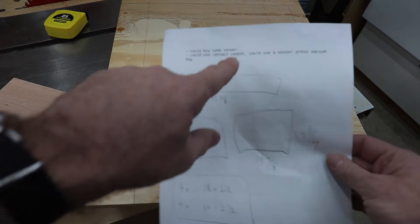To start with, I've got this piece of plywood underlayment, about 3/16ths of an inch thick. I'm going to want veneer for the outside of the panel and also for the inside, because you'll see it when you open the door and it's structurally better to put the same thing on both sides. The veneer needs to be less than an eighth of an inch — more like a sixteenth — so I don't end up with a massive thick piece of plywood. My big bandsaw is great for resawing, but I've never done anything quite this thin and don't have a thickness sander, so I'm going to experiment. I've got it set to just over a sixteenth in thickness, so let's see how it turns out.